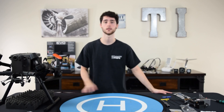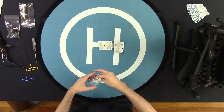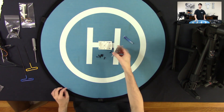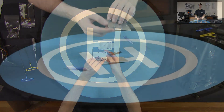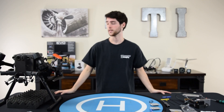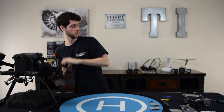The first step in the process is to install the mounting plates. In this bag you'll have the two mounting plates. Take those out. We have a tube of Loctite, and we should have eight screws. On these mounting plates you have two screws already installed into aircraft grade nut plates — these are what you'll finally tighten down to lock the drop mechanism in place. These should never come out and they shouldn't need Loctite either. Next, we're going to take the aircraft and remove the batteries, so we don't want this turning on in the middle of installing.